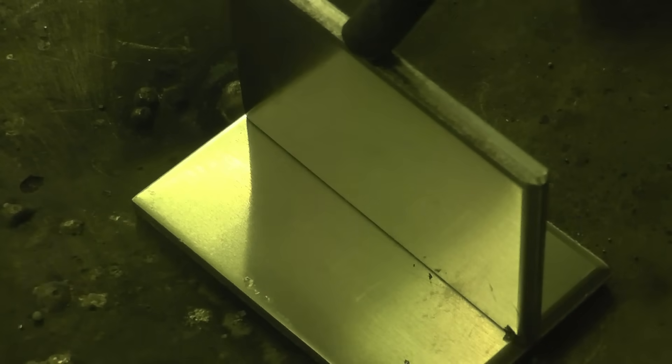Carrying on the same as I did with the 4mm plate, this is a 6mm T-joint set up. I'm going to try welding it on exactly the same settings as I welded the 6mm lap joint.